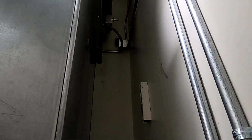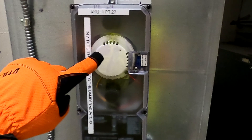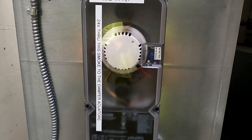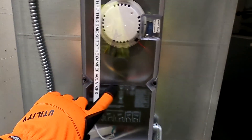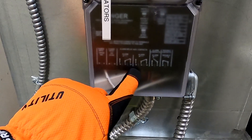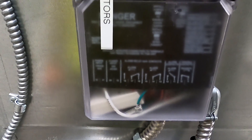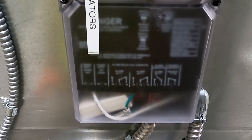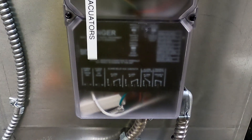The return and outside air damper is on the other side of that wall. As our 24 volts comes through the smoke detector and goes to the relays to fire 24 volts to the actuators, that keeps them open — unless the smoke fires. We've got it through a normally closed set of contacts right here. If it alarms, it'll open that up, kill the power to the actuator, and it will shut the dampers so we can't spread any airflow or smoke through the building.